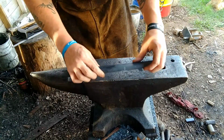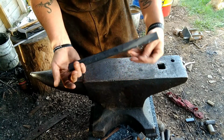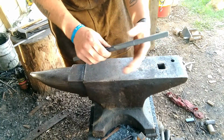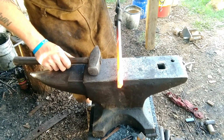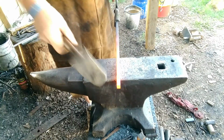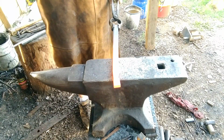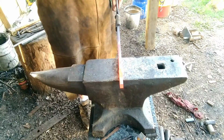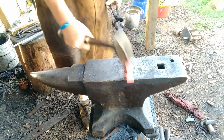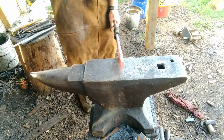Mimic that to the other bar. 1/2 inch by 1 inch flat bar, 13.5 inches long. Same measurements as bolt jaw tongs. You need 2 pieces of that, so you need 27 inches total of it. Cut it in half. Come out of the fire, find your first center punch mark, go to the far edge of your anvil, just like with the bolt jaw tongs, set it down. Back to the near side of your anvil, find this second center punch mark, set it down.